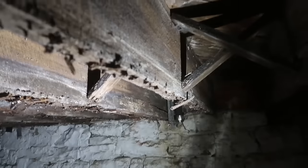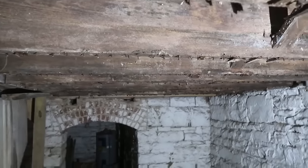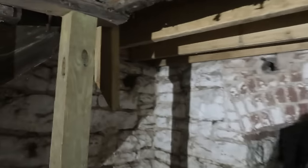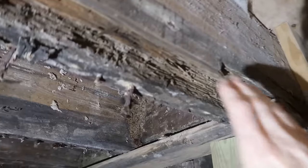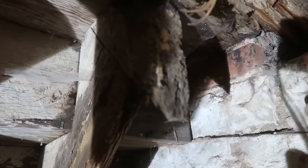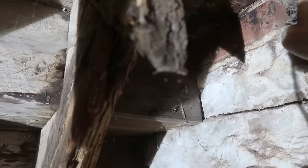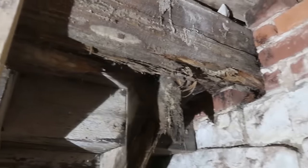Well, like Carrie mentioned a couple times, all of these floor joists are leaving. They're all rotten. So we have to take care of all these. This area is the triple, we're going to put the triple floor joists and pocket them back into the brick. Of course, this one has seen better days. These brick pockets were allowed to get wet and termited.